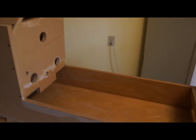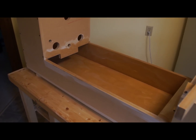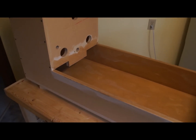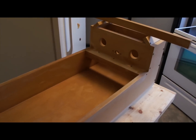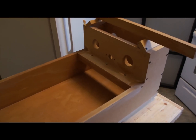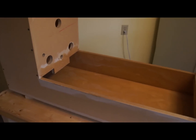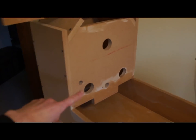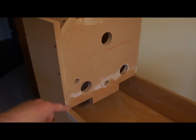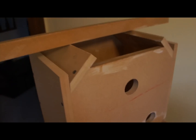Here's the finished mold. I coated everything on the inside — the last coat is drying here — with a water and wood glue mix, about five to ten parts water to one part wood glue. There's a little fan down there and I just plopped this in the middle to pull air through and help dry the coating a little faster.